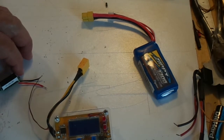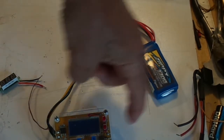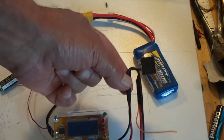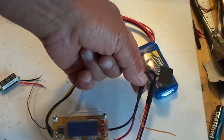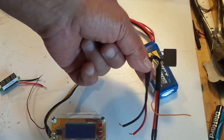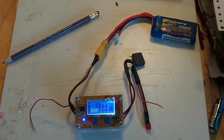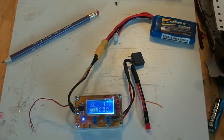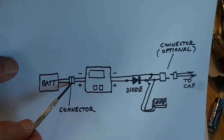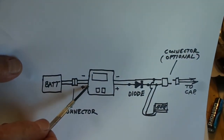The unit is all calibrated and ready. Now, specific to using it for capacitor charging — let me explain the wiring. On the input side it's just an XT60 connector, properly polarized, going to the left-hand input side of the power supply. On the right-hand output side, positive and negative go out to the charger through a diode. That diode is there to prevent any backflow, and with it installed you can use this as a LiPo charger, NiCad charger, or whatever — anything where you know the desired charge rate and float voltage.